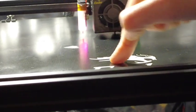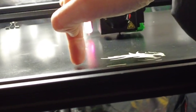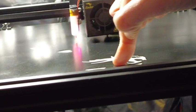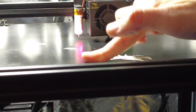If the nozzle is printing from too high up, the filament will just come out like a slug and won't stick to anything. You want it just snug enough to get a slight squish. Too low and it will block the nozzle and drag. You want a nice little bit of squish — a nice drag line — and when you get that nice little curve it's perfect.